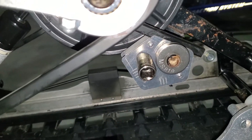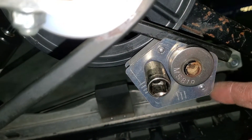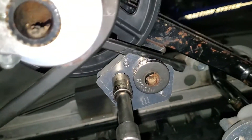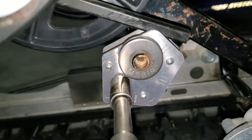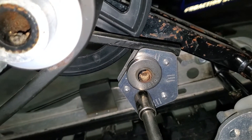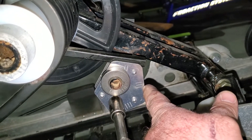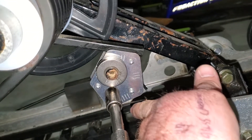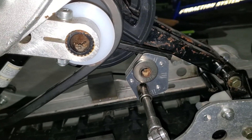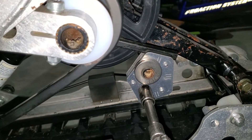Now adjusting these — if you want to put it back to the original setting, I went ahead and sprayed just a little bit of lubricating oil around here to make it a little more slippery. Use a 13 millimeter socket on there. That's position one, there's position two — that is the stock setting right there, which is where we're going to leave this one. Position three is the heavy setting for stock, and position four is all the way around at the bottom. I've never used these on the high setting — always on the medium setting — and I've always had good luck with that.